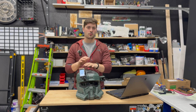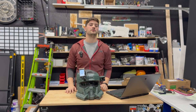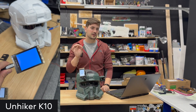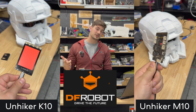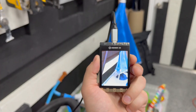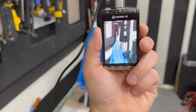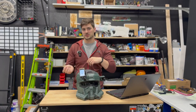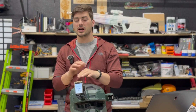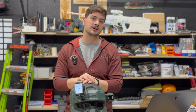With the camera in mind, I wanted to figure out what computer or tiny screen device I would use so I could see it locally but also stream the video feed back to a desktop. I found the UniHiker K10 and UniHiker M10 boards from the brand DF Robot. Right off the bat the UniHiker K10 was honestly pretty impressive — for literally just a few bucks it had an onboard camera that out of the box immediately started feeding video. But it was attached to the board with a ribbon connector, so upgrading to a good infrared camera wasn't as simple as just unplugging and plugging back in. Even though it's a pretty awesome board with a lot of onboard sensors and interesting IoT applications, I realized pretty quickly I wanted to check out the beefier UniHiker M10.